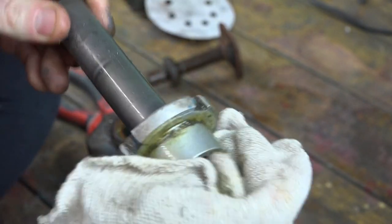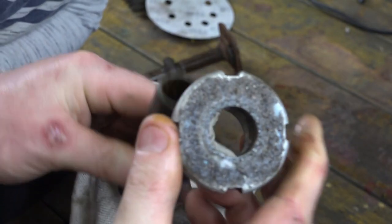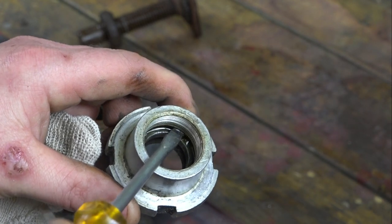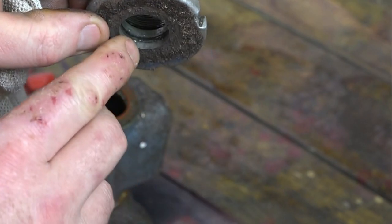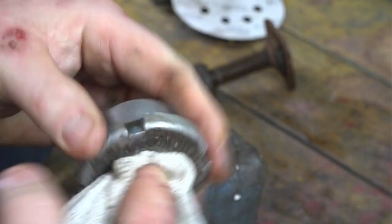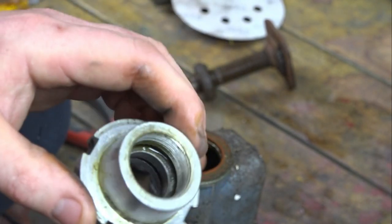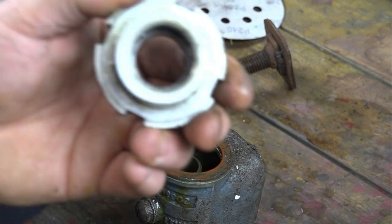The seals inside a hydraulic ram are inside there. If you look in there, you've got a polyurethane seal which is the first one - it's like a leathery plastic, a strange feel. And on the other end, this plastic seal is just basically for muck. So when people see a hydraulic ram with a bit of this seal stuck out but it's not leaking, it's because that actually doesn't hold any pressure. The only one that holds pressure is the one inside there. On a big ram you'd have four or five seals in there.